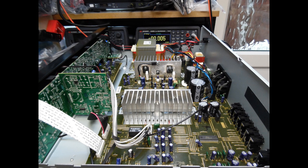The amp should then energize the startup relay - you hear it engage - which provides power to the toroidal. The amplifier had plus or minus 15 volts on the low voltage power supply regulators with no issue, and that confirmed the toroidal transformer primary was not the problem. The microprocessor was working because it was operating the startup power supply - so all good.